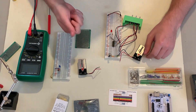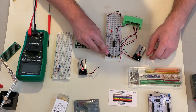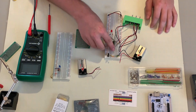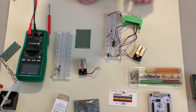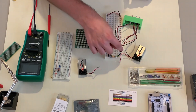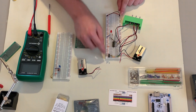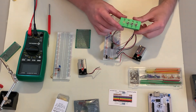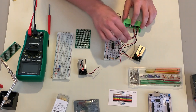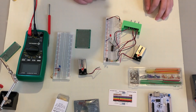Since I don't have a variable power supply, I made a little nine volt to five volt adapter using this chip here, with some capacitors to smooth it out. I'm also taking advantage of the power rails — I've got my switches connected on power and ground rails, which run all the way down. I have a small 3D-printed case to hold the switches so I can easily switch them on and off, and it's modular so I can move it to another breadboard to test another circuit.